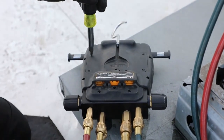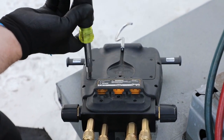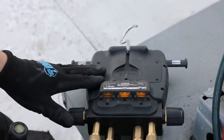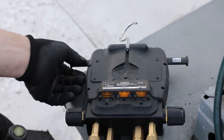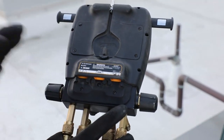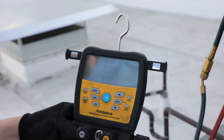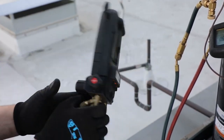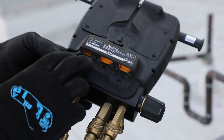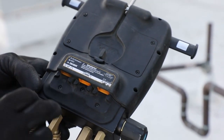While I'm pulling off this battery door, let's talk about these ports. The S-Man 480 itself does not come with the wireless clamps, but it has the capability to be used with them. From the factory it'll come with the standard clamps that plug into the back — they've actually moved the clamps to the back, which is a very cool feature, because on the older manifolds the clamps used to be in the front and weren't very user-friendly. Now they're in the back with a little handle that holds them in. You have an outdoor temperature measurement, a suction line temperature measurement, and a liquid line temperature measurement.